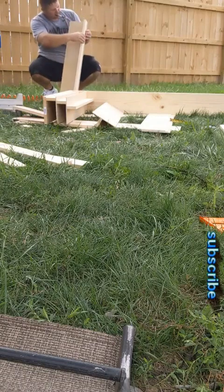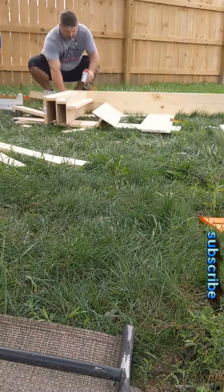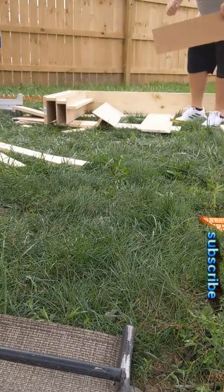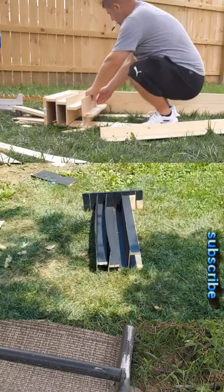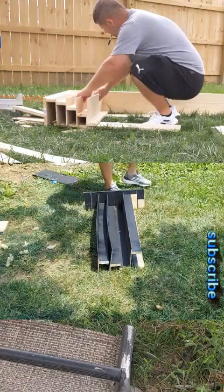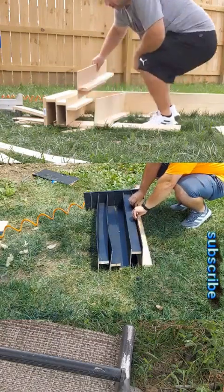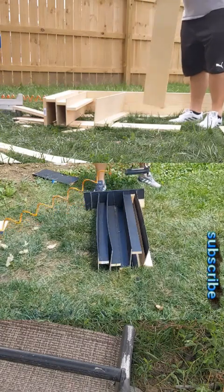I'm lining up the one by three pine board with the one by seven piece of underlayment. I put a clip in here to show you how I nailed this together from the side — I used a nail gun. You could use glue if you were more patient. Once one piece is built and flipped into place, you nail that one on, then have the next one ready to go, because trying to nail from the back side would be difficult.